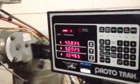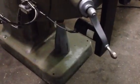You can see there the 3-axis digital readout display. The spindle is running right now. That's your reader head for the quill, and over there you see the reader head for the cross. That's your servo motor for your cross — that's your longitudinal and cross. Also there, your hand wheels. You've got ball screws on the X and Y-axis.